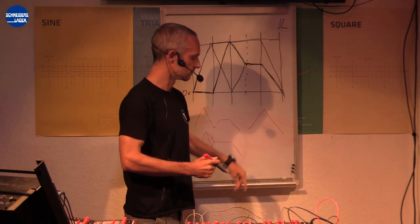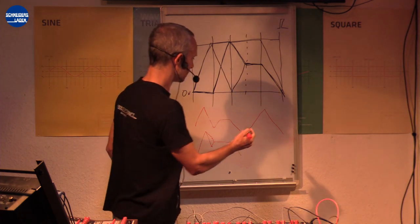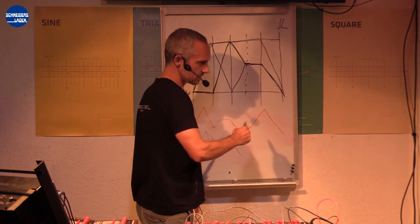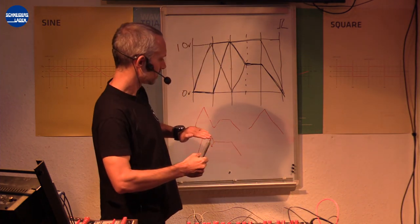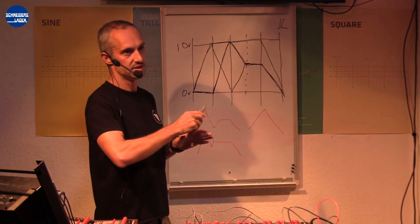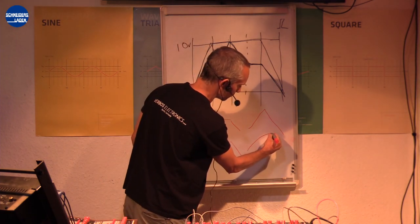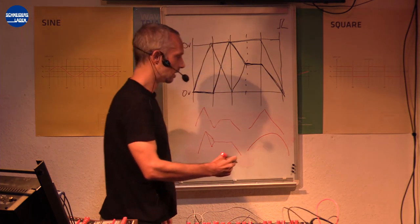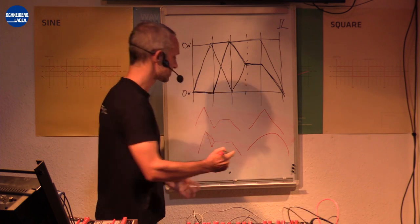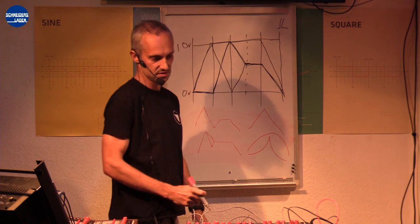And if those are envelopes that are based on just simple rise-fall envelopes, and then there's a general CV input, the way that they create these curves is that they use feedback from the output. So if you were to feed back the output of something like this back in and make it so that the increased voltage going into the times makes the times longer, you'd actually make the shape turn into something more like this. And if you did it where the higher voltage makes the times faster, you would turn it into something that looks like this. But neither of these is actually